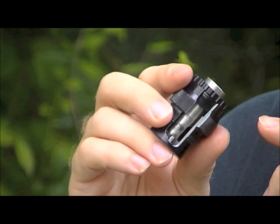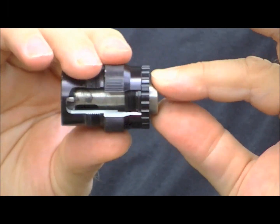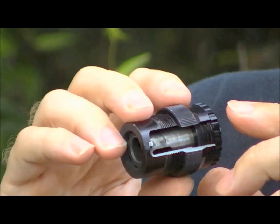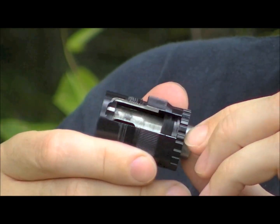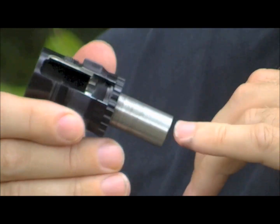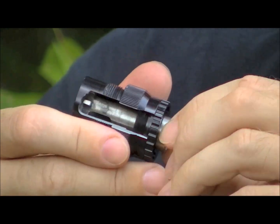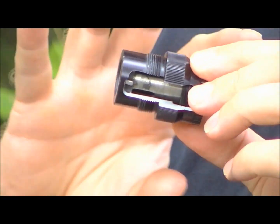I've removed the spring from the booster so the piston will move freely. The goal here is to show that there's nothing really magical inside this housing. This piston — which in actuality is not a piston, it's a decoupling device — doesn't really push anything. What it's doing is disconnecting the mass of the suppressor from the gun barrel temporarily.